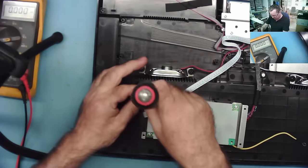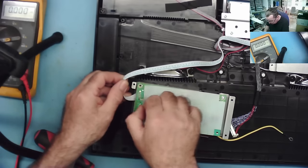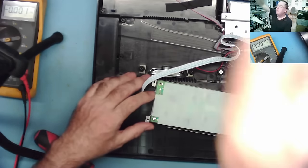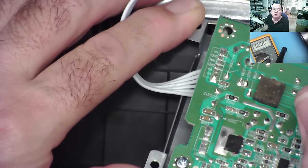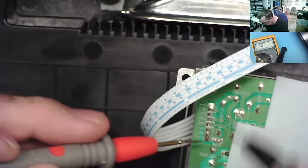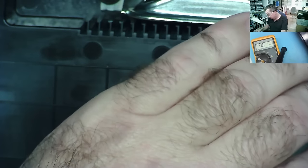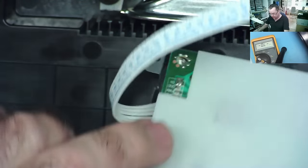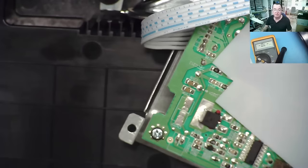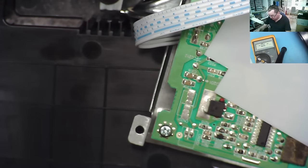What I'm going to do now is try to power this up with the board attached. But just prior to that I want to check for short circuits on the output of here in case the problem is a short down there. We can see where the outputs are — let's just check on the resistance range. No short circuits on there. There's no short on that output either. There could be a short on the LED output — it's possible there's a short on the LED backlight itself. That needs a very high resistance — mega ohms — that's what you'd expect to be honest.